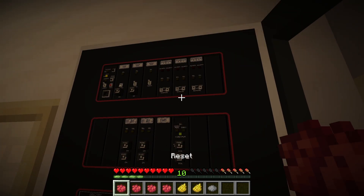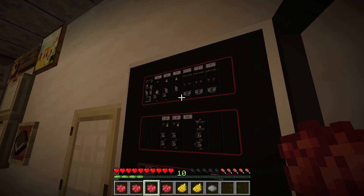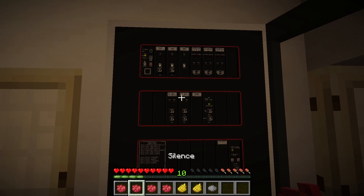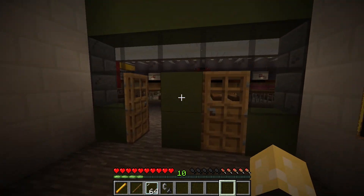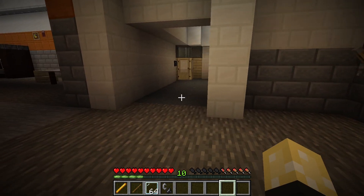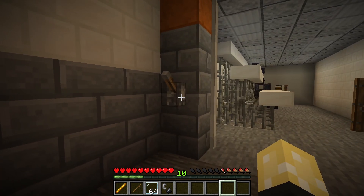It's kind of boring on the panel side, but I'm usually pretty lucky because my co-worker would rather do that and let me walk around and pull stuff, which is more fun. We just go through the same process until all the initiating devices have been tested. After that we re-enable everything. In real life we'd probably leave the doors disconnected, but I want to show you those because they're kind of cool. For this building I put in some old roll-up style fire doors — they're also used to close off areas. I linked them to the fire panel so if it trips, it'll close them.